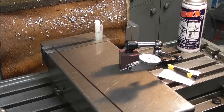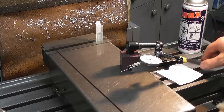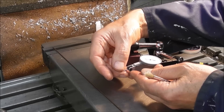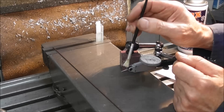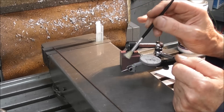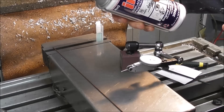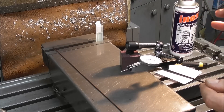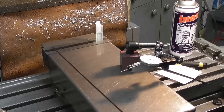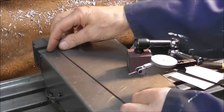Let me show you how you can do that. The first thing I did was back off the little screw so it is definitely loose — it's really rattling around in there. I get some kerosene on a little hobby brush and brush out the bearings to make sure it's all clean, coming in from both sides and really flushing it out, then putting a little bit of Inox lube in there — just a very fine oil — in preparation for making the adjustment. The best adjustment is to take the play out of those bearings but not so much that I'm adding any friction.